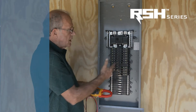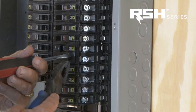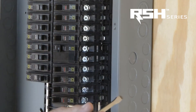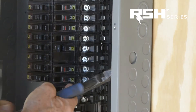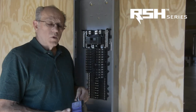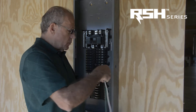We need to locate a knockout to be able to go ahead and put in the installed circuit. We have a 30 amp breaker right here and a knockout directly across from that. So what we are going to do is knock this out. Now that we have our knockout knocked out, we are going to go ahead and install the surge protector on the panel.